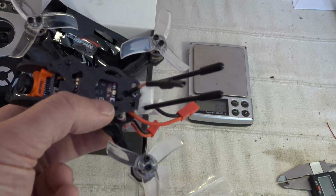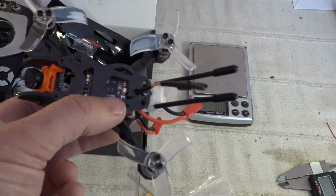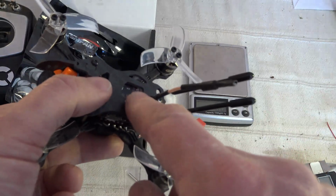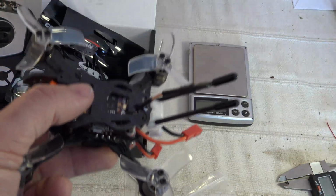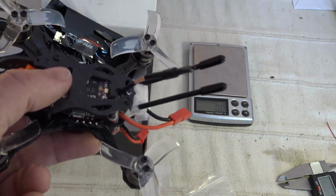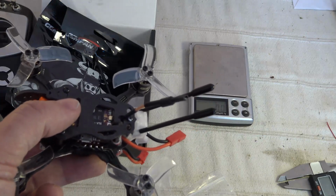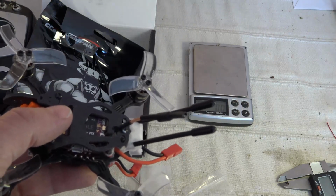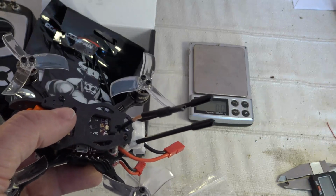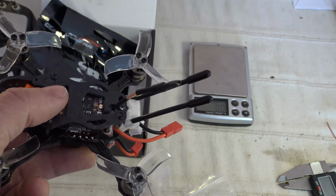First, if you press and hold this button 3 seconds, you will enter the VFREQ selection. You will see that the blue light will flash, and the number of flashes is correlated with the current VFREQ selection. So if you see only 1 blue flash, it means VFREQ 1, 2 blue flashes is VFREQ 2, and so on. If you are in the channel selection, with a blue flashing light, and you press and hold the button 3 seconds one more time,